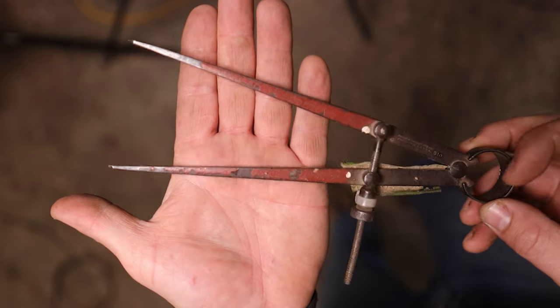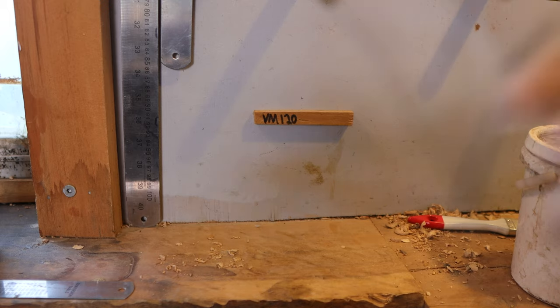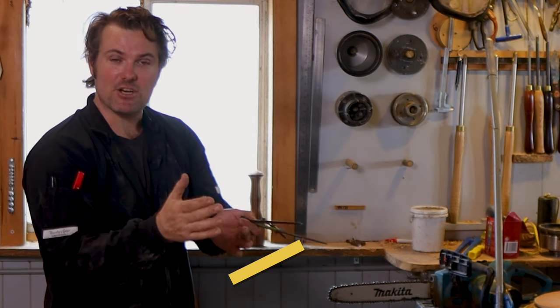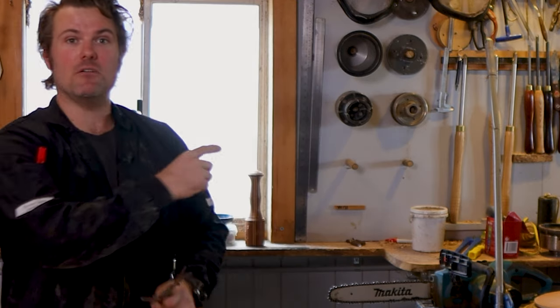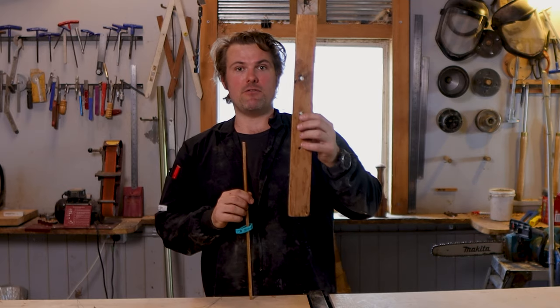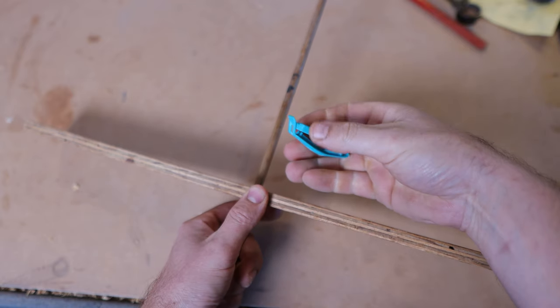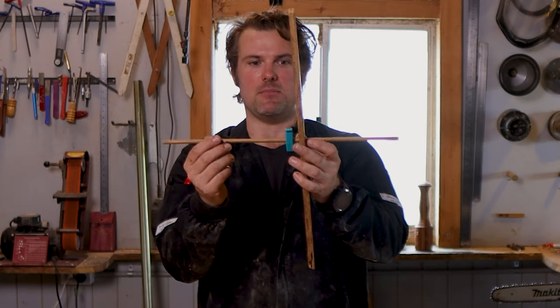Dividers live in the magnet tray. On the wall I have the measurement for my chuck jaws that I use primarily — that way if I haven't set up before I started turning and I don't want to take the piece off the chuck, I can come over to the wall and take the measurement off that little template. This is a homemade depth gauge — I've made a video about it, I'll link it in the description — and this prevents me from going through the bottom of the bowls. I've since added a little bag-sealing clip through one of the holes so I can lock in or easily adjust the measurement.